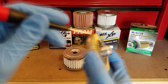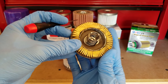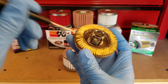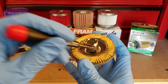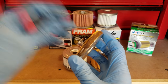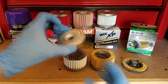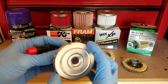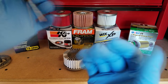While I've got the end cap assembly in hand, I also want to point out their gluing job. They've got a lot of glue — plenty of it, maybe almost too much. It's almost crept up to the point where it interferes with the seal on that valve, which I would be wary of from a manufacturing standpoint. The glue also spills over the lip of the end cap, and you can see a bunch got on the bottom. I don't think that hurts performance at all, but it doesn't make me feel like they paid attention to that extra level of detail.